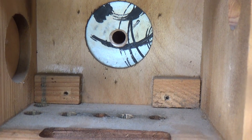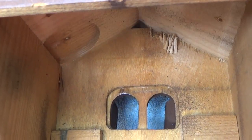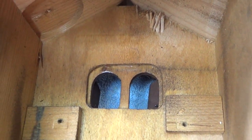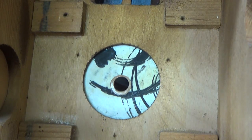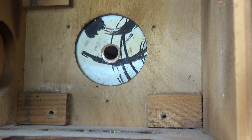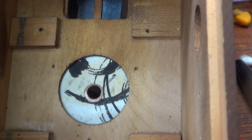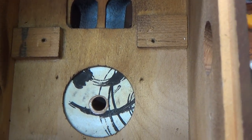And we're going to clean on the inside of this, remove whatever caused the pieces of wood to be splintered up there, and then we're going to coat the inside of this with a 50-50 mixture of linseed oil and mineral spirits to feed the wood and eliminate any odor and dusting.